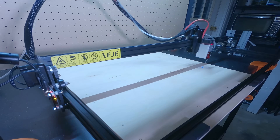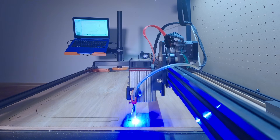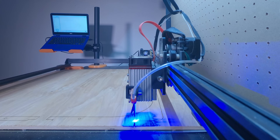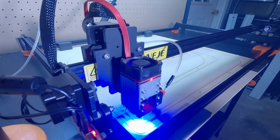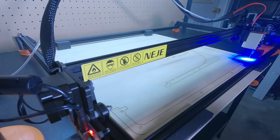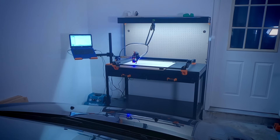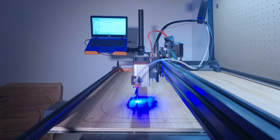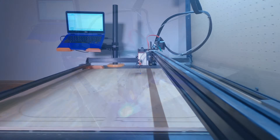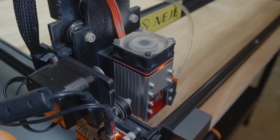So, with that established, it's on to the feature build. It's probably worth noting that 100mm per minute isn't very fast when a laser has to cover a distance of more than 6000mm per pass, 6 passes per layer, and all the travel in between the features. At this rate, each layer took about 7 hours to complete, and if I may point out the obvious — yeah, this is hilariously impractical, especially as I've only been able to supervise one cut per day. But it's also the mother of all stress tests for a diode laser engraver claiming to cut wood, and this one does — relentlessly.